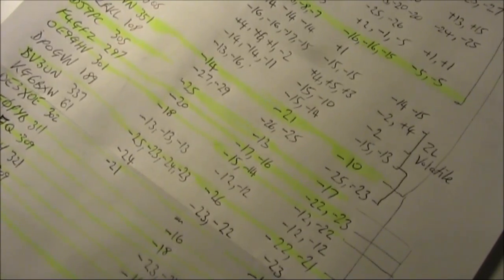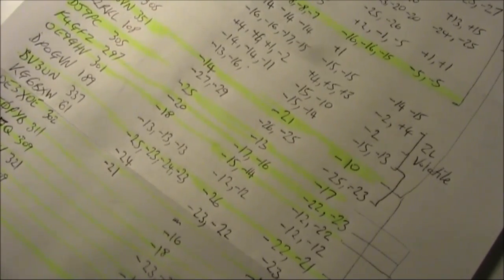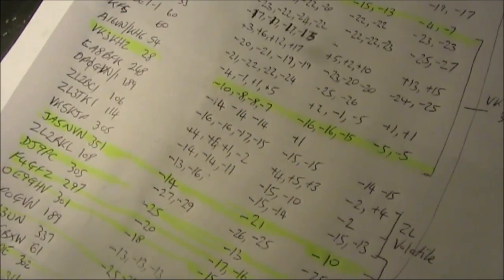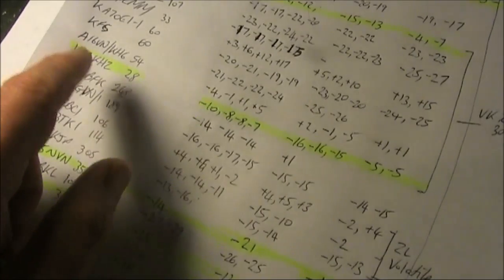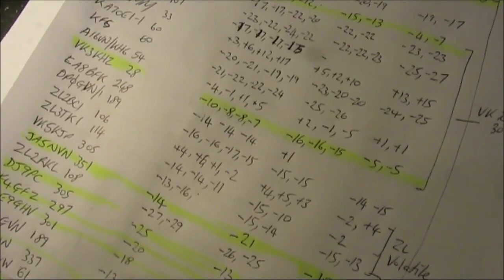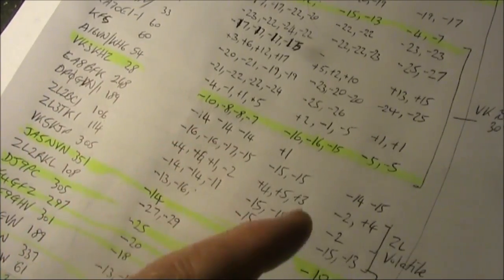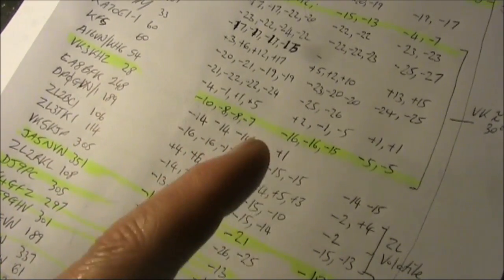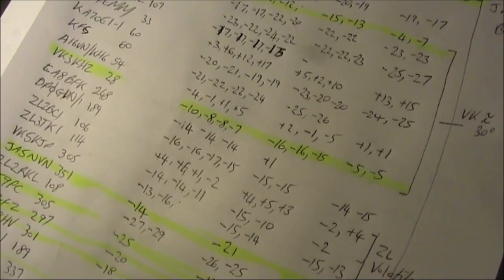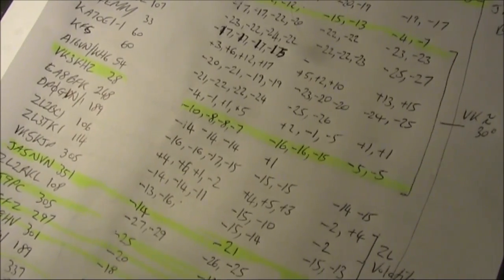In summary, very big differences for Japan and Europe, which is where I deliberately positioned the nulls. In retrospect, I should have looked at American stations more and tried to align a null for them. I didn't, and as a result the American reports are quite similar between the different antenna positions — it might be a bit of a pattern, but not strongly so, because I didn't have the null centred on the US in any of the three positions I tried.